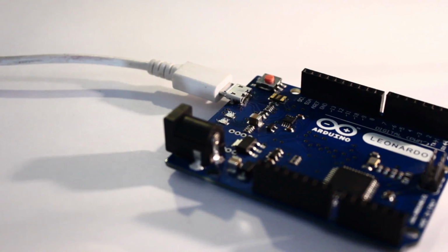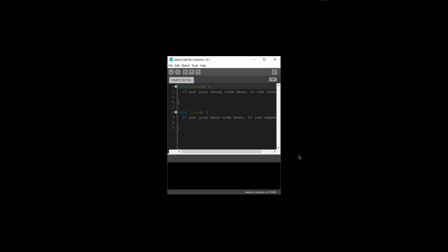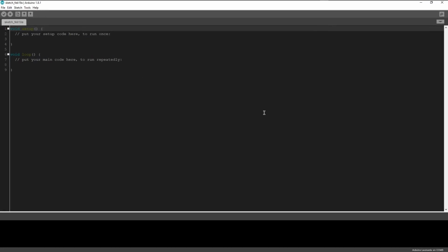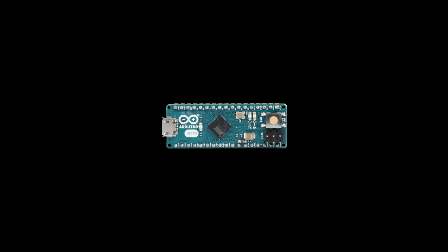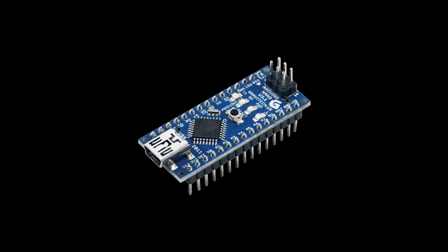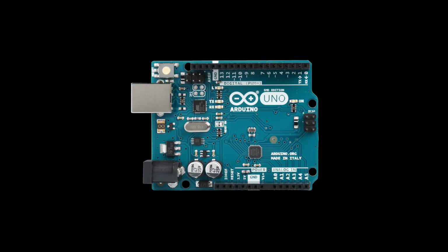The most common first Hello World example that people do is to try to blink an LED, so that's exactly what we're going to do, first using an example and then by ourselves. Most, if not all Arduinos have an LED soldered onto them that can be controlled by the user. This LED is usually connected to digital pin 13, but it depends on which board you have. We'll talk more about the digital pins in a moment, but first, let's get the LED blinking.